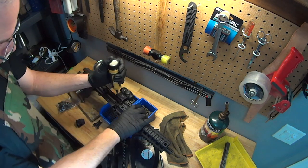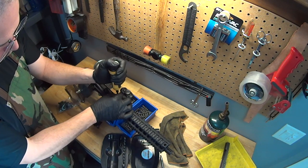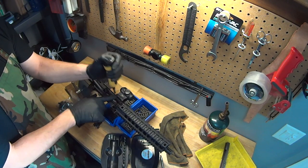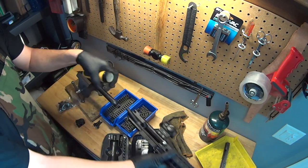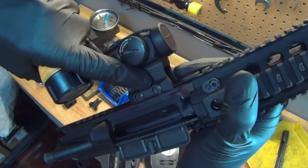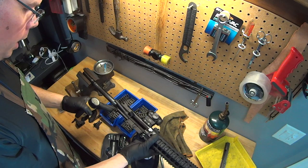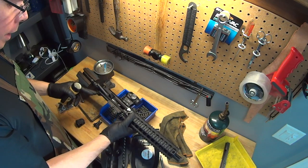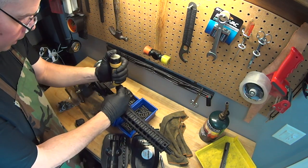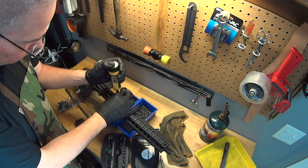Down to the bottom. Hang on to it and rotate. Make sure that this is dead center, because if this goes to one side or the other, you're going to end up with that little mark right there, which is what I did years ago. I miscalculated before I started putting torque on it, and I heard it, and I went, yeah, that's not going to heal. Can't put a Band-Aid on that.